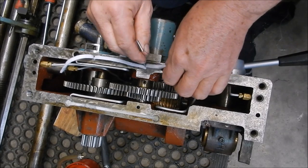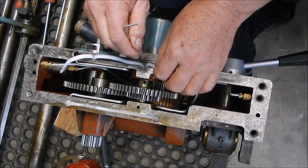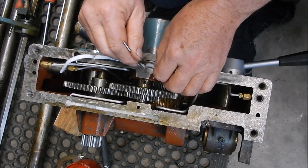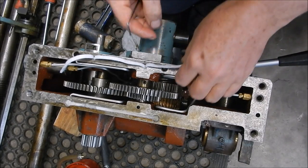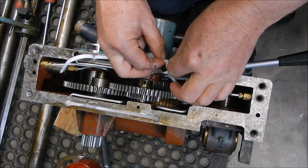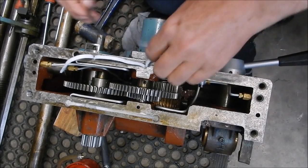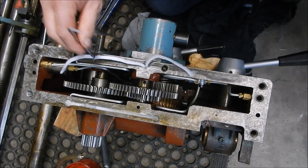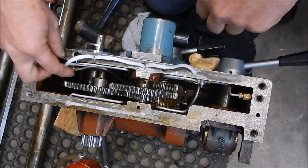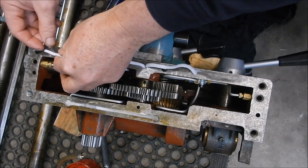Just going to fit in there. And as that felt is wetted with the oil it will wick, and felt does wick very, very well — probably nothing better for wicking than felt. So we've got them down a little ways in there; where we've necked it down they're quite loose in there, which is good. I just need to ball the ends up to fit into those little cavities.